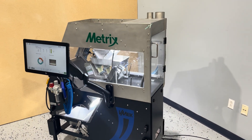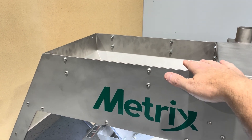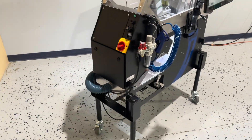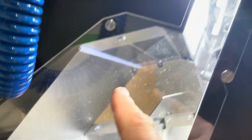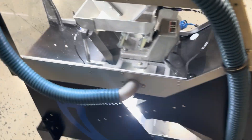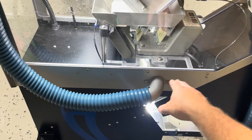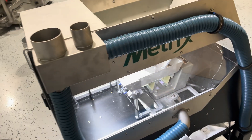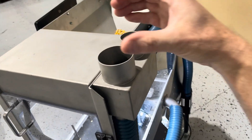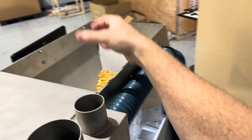Now that we've kept the dust inside, with the addition of the cover not shown here, we have fully integrated dust collection. We get the dust from underneath and through those vents, and then we also collect dust from the general area using this connection. They're all unioned together on top of the machine — the customer brings their three-inch connection and we bring our two two-inch connections into the top.